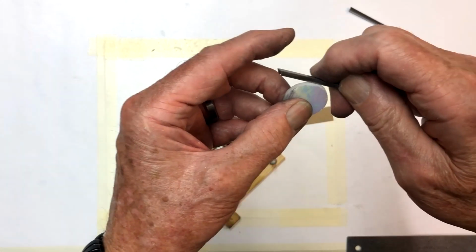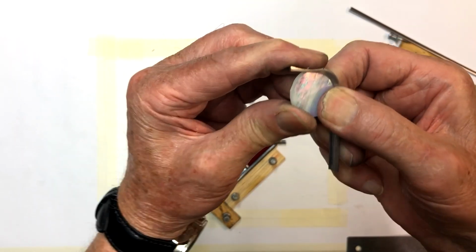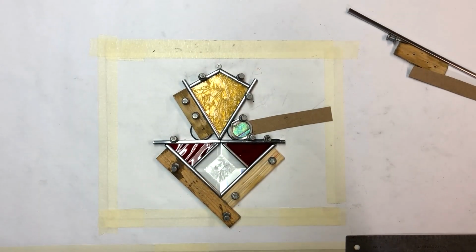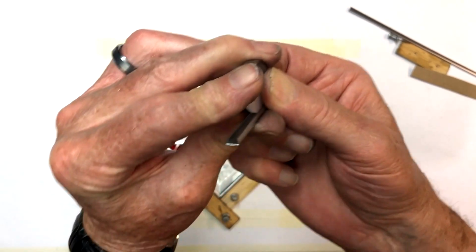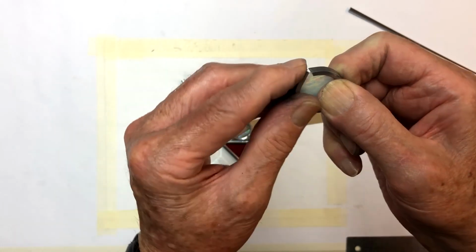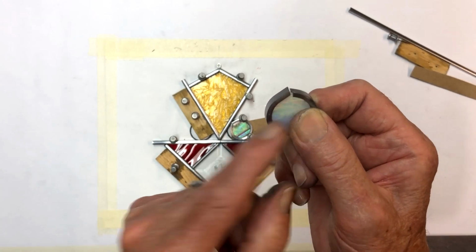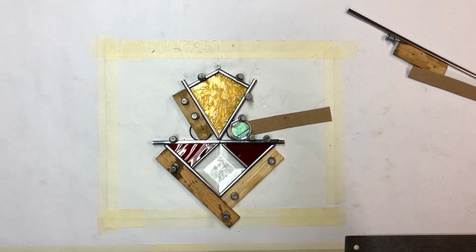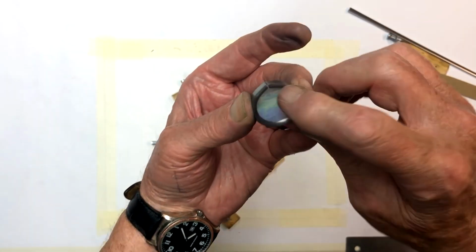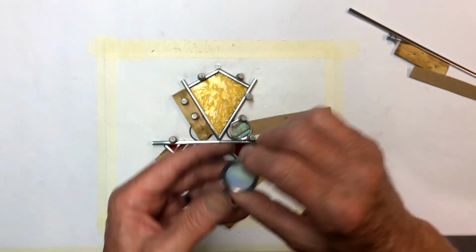Here again, I'm going to start it right here in the middle. Come on around. Pull it around up against your workbench. Push that in tight. Bring this on around here. When they almost come together, see the reason for cutting it on an angle? That'll make you get a good tight fit right there. Push it in on your workbench. And there's your joint right here. So that gives you an idea how to do that.